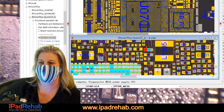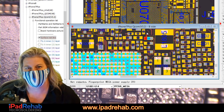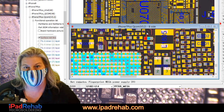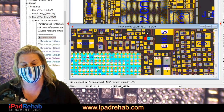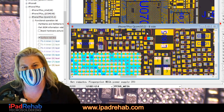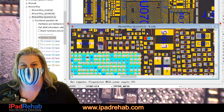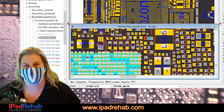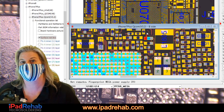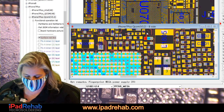So if you're just joining us, the point is not, hey, let's figure out why this phone is not turning on. We're trying to figure out why this phone leaks about 200 milliamps to ground. The main power rail doesn't appear to have an abnormal resistance to ground. So there's not a short on main, there's not a short on many of these common power rails, but something is leaking electricity to ground from the battery. A phone with a tiny leak can get by, but a 200 milliamp leak is a pretty serious leak. When you try to prompt it, it tries to turn stuff on, but it hangs at around 200 milliamps after prompt to boot.